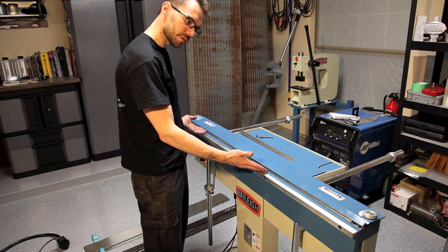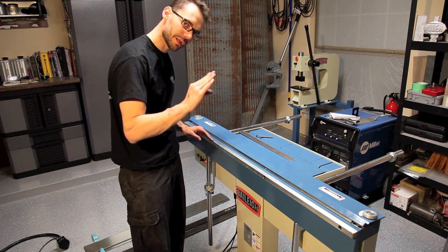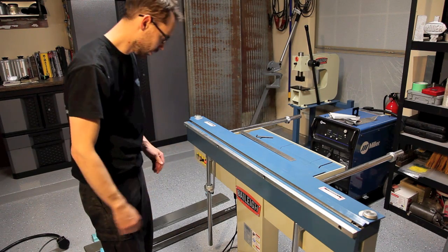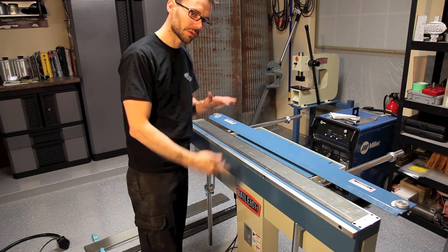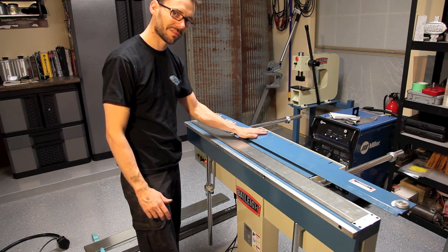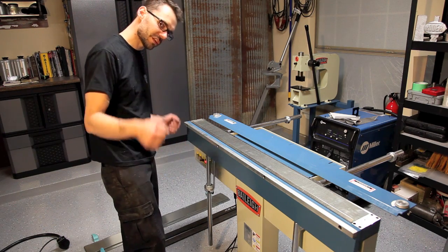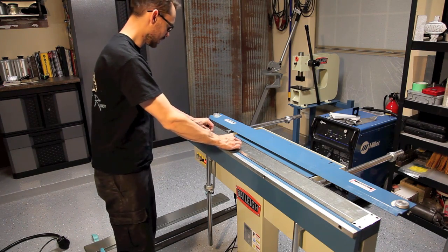What I've done is scooted my material back just a little bit — it's underneath here. I've set the clamping device on top of that. I've got it bent as far as I can, but I want it to bend all the way to make a complete hemmed edge the whole length. So let's see if it will clamp it down on its own. The machine is on — here we go. The force was not quite enough because of the air gap in between the two pieces of metal, so I'm going to try something different. I've removed the clamping device and I've just got the sheet metal sitting there. The machine is on and I'm going to hit the foot pedal and see if I can get it to bend all the way around. It does lock it down — pretty good it seems like.